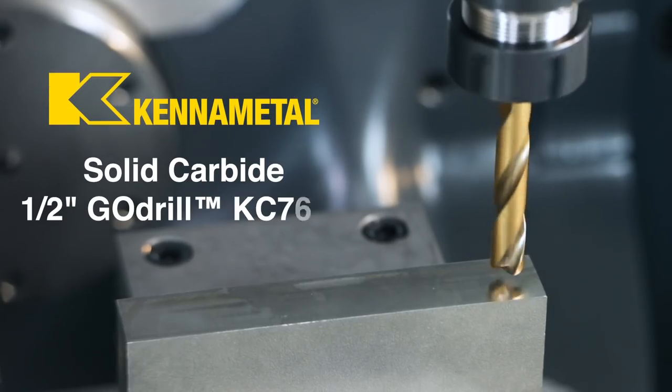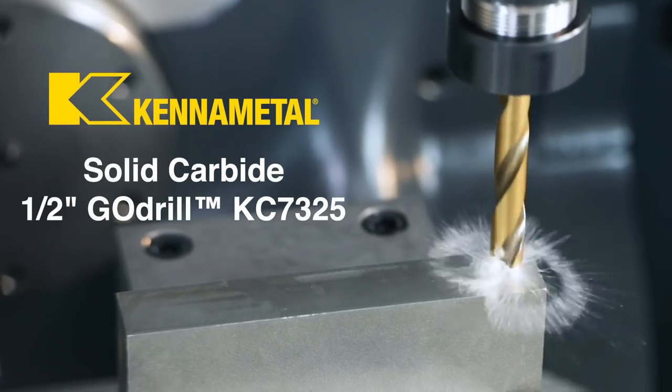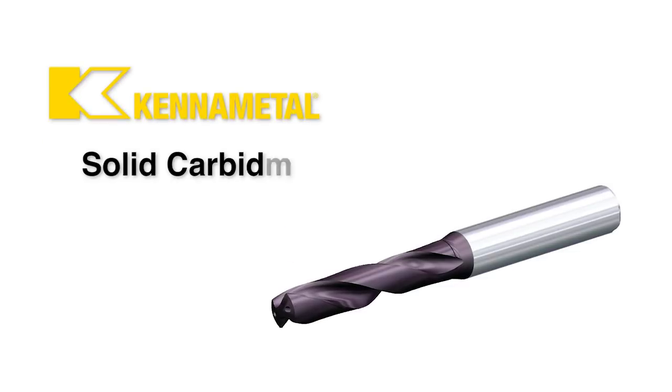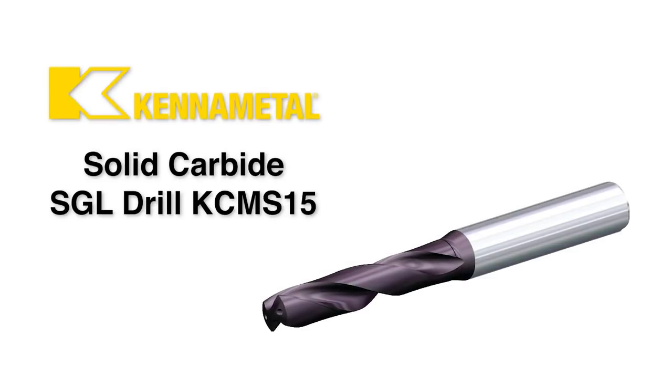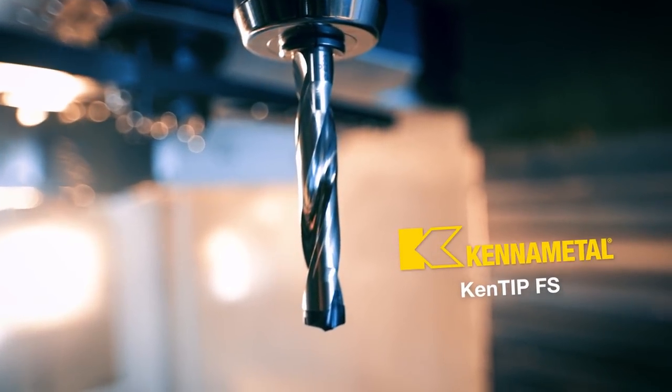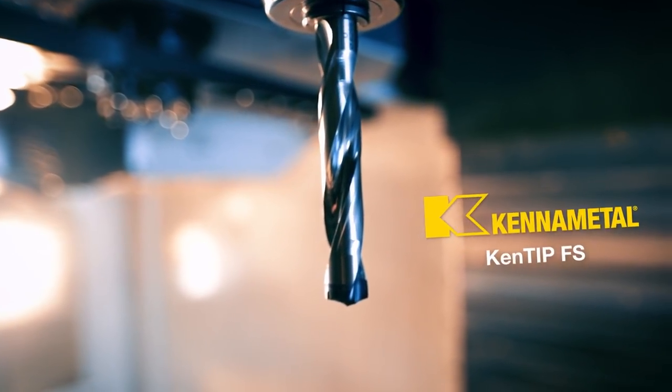A lot of you guys know that's my workhorse right there. I like the GO drill, especially in aerospace, because we make so many different parts and have so many different applications, we can just have the same drill for all of it. If I was in automotive and I had a million stainless parts, I would go to the SGL drill, which is amazing, or the Kentip FS for that application. Now getting back to the GO drill and this application in Hastelloy.